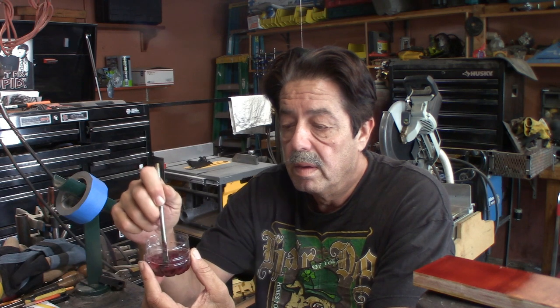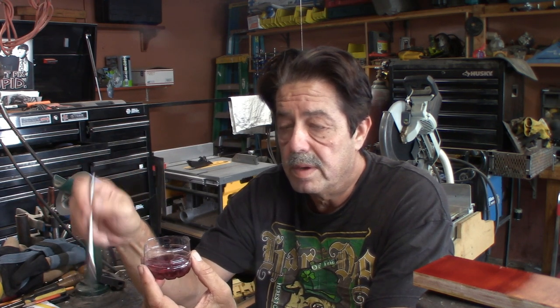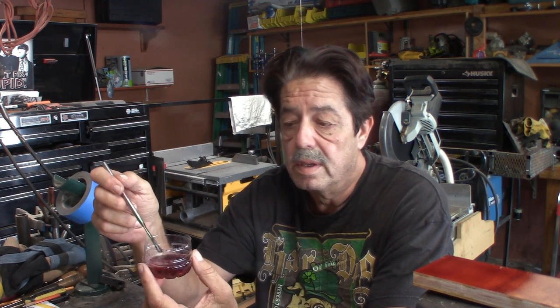I also use this a lot of times like in this little container here — I put some transtint dye. With these brushes I just go ahead and stir it up. I can clean this off fast just with lacquer thinner again, because I've mixed it in with brushing lacquer. I can just swirl it around, clean it up, tap it off, lay it on the bench. When I put it back into that lacquer thinner, it softens back up. So I don't really have any cleaning issues because I don't want to spend time cleaning brushes. These are real great, like I said, for the throwaway.